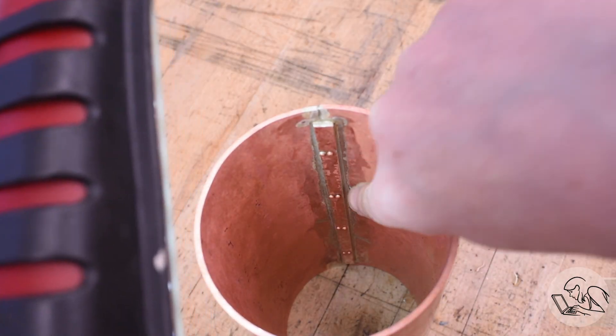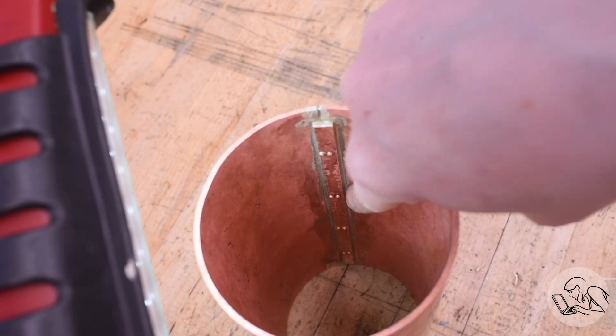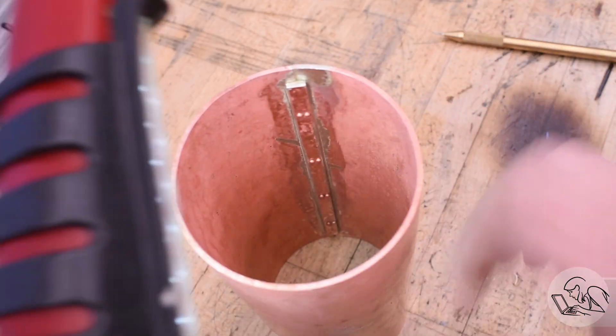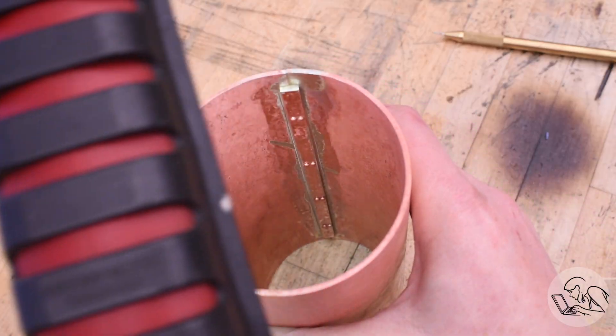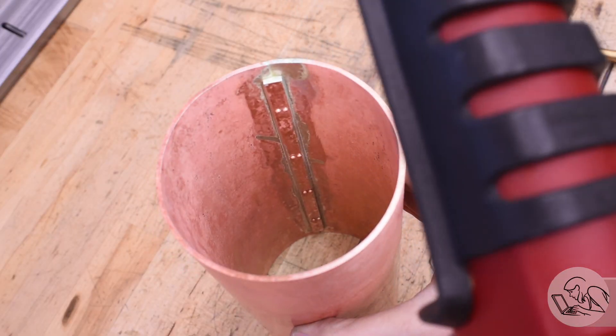Here's where we left off. I had just finished the riveted seam in the shell, and the shell's been squared up and faced to length. Now we need a whole bunch of fancy holes in it. A locomotive boiler doubles as part of the frame — a lot of the accessories are mounted to it, so we need holes for bushings, studs, and other things.